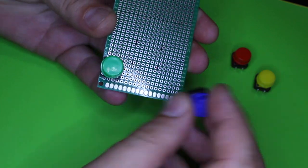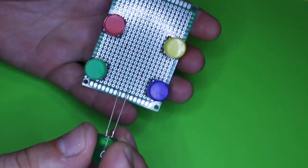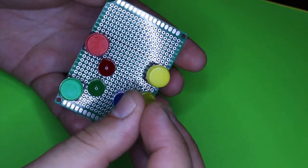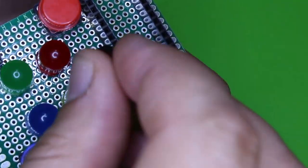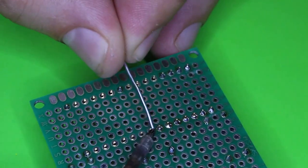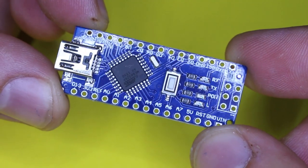First I'm gonna place the tact switches and LEDs. The schematic and source code you can download from the link below. Next, I'm placing female pin headers for Arduino Nano and the piezoelectric buzzer. On Arduino Nano, I'm gonna solder male pin headers, so later I can join it with my prototype board.